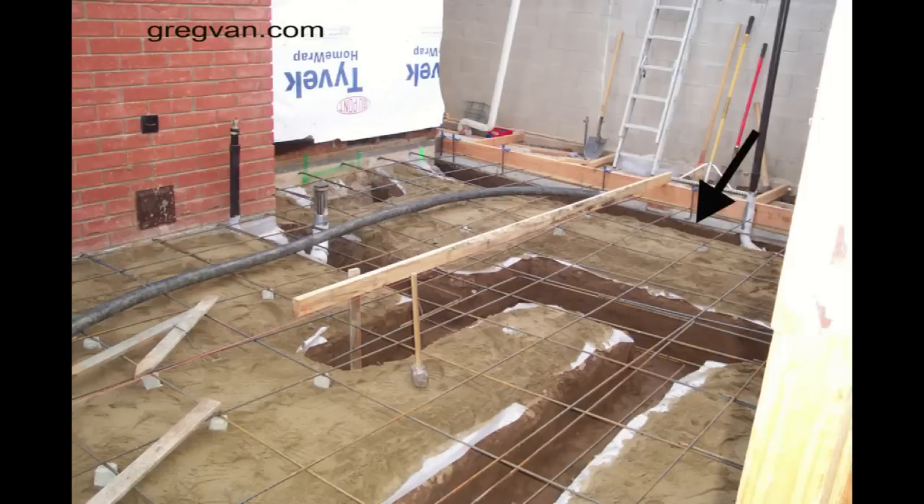This would be a concrete floor slab. You can see right here that we have an exterior wall — this is for a room addition — with a footing. These footings are usually going to be 12 inches wide and about 12 inches deep for a single story, and for a two-story they are going to be 15 inches wide and about 18 inches deep. But don't forget this can vary — I've dug them as deep as 24 inches and 18 inches wide for a single story.